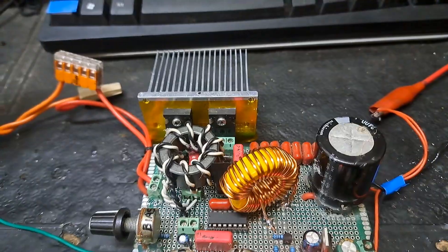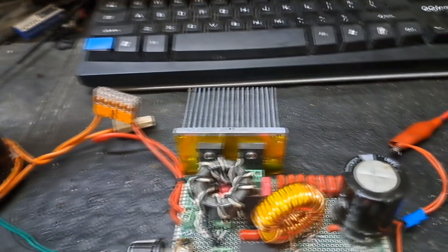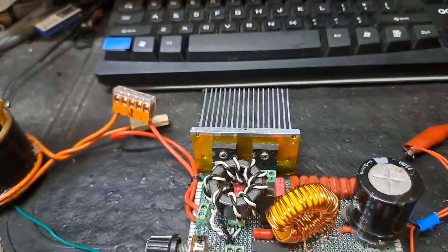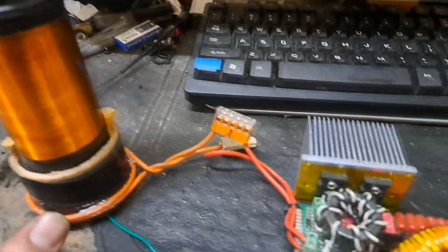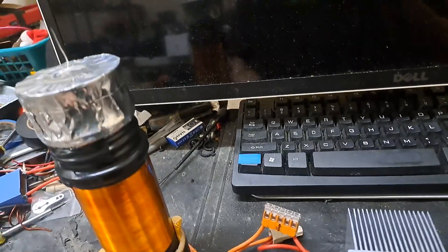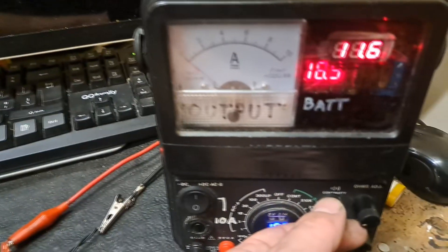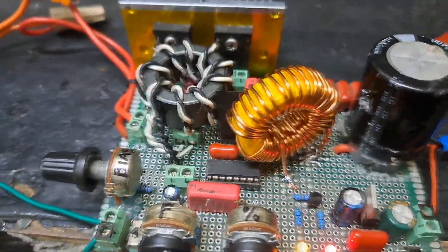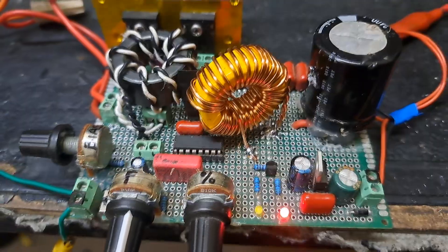Of course, if I really played with it long enough and tried to get really good tuning, then I'm going to get pretty damn long arcs from the low voltage. In this case, I've just wound a couple turns, got the phasing right, threw it around this guy, added a little top load. I got this guy set at about 12 volts, and it's actually on right now. This is the deal where I've got the TL494 PWM interrupting it.